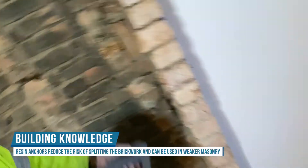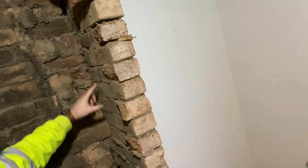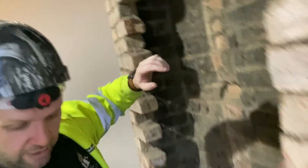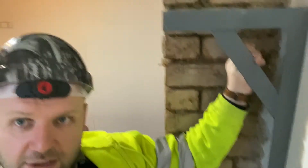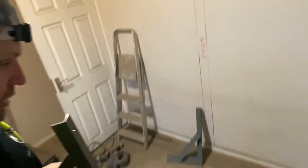For more clarity, that's how it fits to the wall. We would fit one bracket in the loft, so we remove this brickwork and fit one there, then fit the other one on the other side — holding the sides. This might give you a better visual representation: imagine that's stuck on the wall. Any of the brickwork beneath it isn't needed anymore because the bracket is holding the weight. We then get another bracket which is on the floor there.